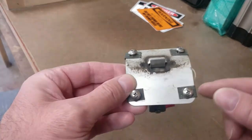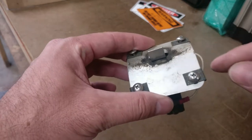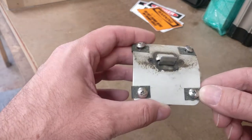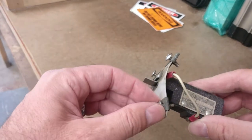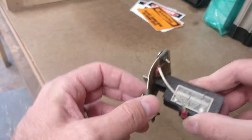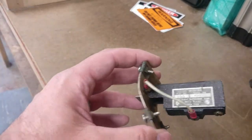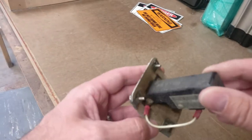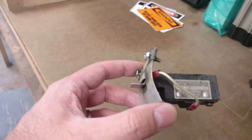And these are called Tinnerman nuts. They're coated with zinc chromate. They're actually steel. So we have aluminum, steel, stainless steel, and then the connecting metal is also aluminum. So lots of potential problem areas here. Dissimilar metal corrosion, problems with these Tinnermans not conducting electricity because they're coated. I don't know. So anyhow, today what I'm going to do is just clean this up. I'm going to get these nuts off of here, and I think when I put it back on the airplane, it's going to work just fine, I'm sure.